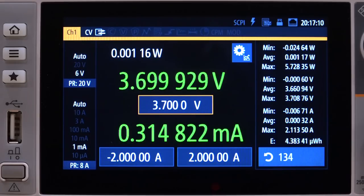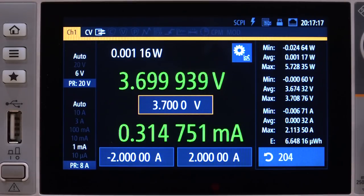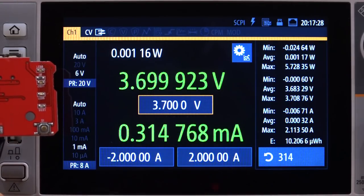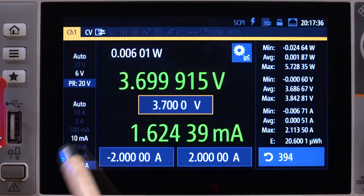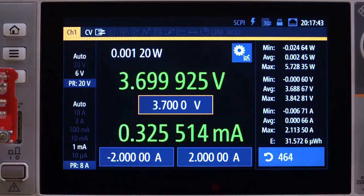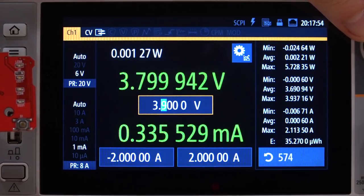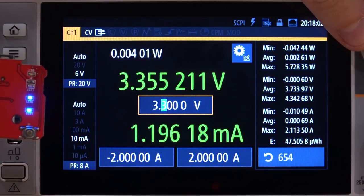That 0.3 milliamp is essentially draining the battery at just over one milliwatt continuously — which is why if you leave a power bank around, it will eventually discharge. Pressing the battery check button causes it to measure, estimating from the voltage. Three out of four LEDs light up and current jumps to 1.6 milliamp, with auto-ranging moving to 10 milliamp. Once the LEDs turn off it goes back. We can change the voltage — increasing to 4.2 volts shows four LEDs; reducing while the lights are on confirms it's measuring battery level.